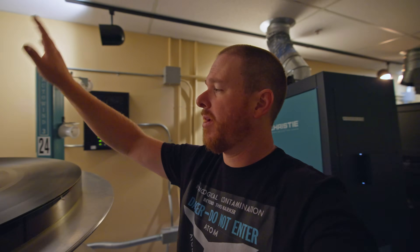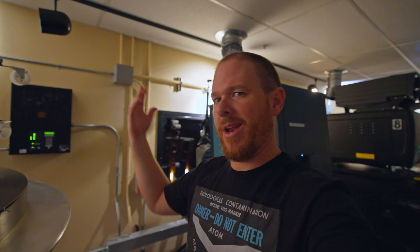Some people have asked why the film is all out in the open and has to go through so many twists and turns. It didn't always used to be like this. There actually used to be two projectors. You would put a reel up on one, play it through, and when that reel ended, you would start the next projector with the next reel and make it look seamless. They have little cue marks that come up in the upper right-hand corner of the screen to let you know when to start the motor and when to changeover the picture. That went away because they wanted a projectionist to run many screens, so they would get rid of the extra projector and put in a platter system.